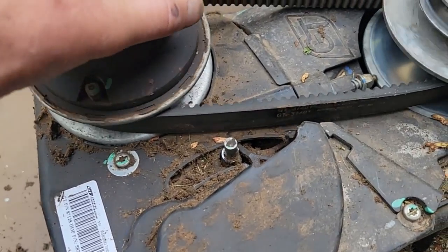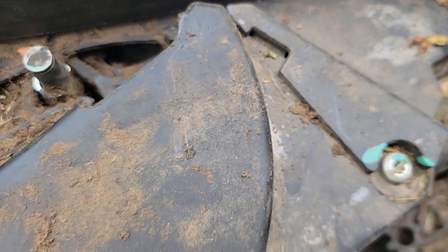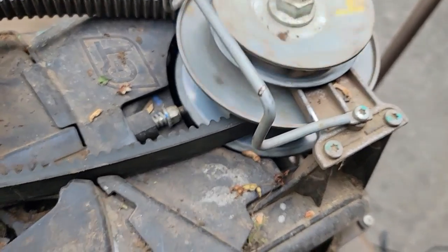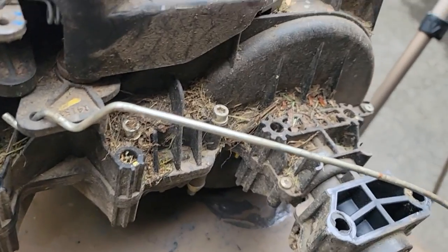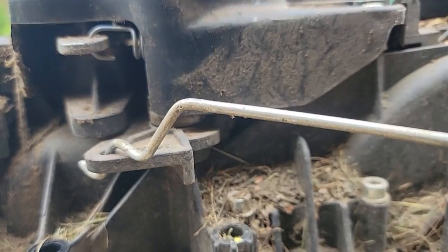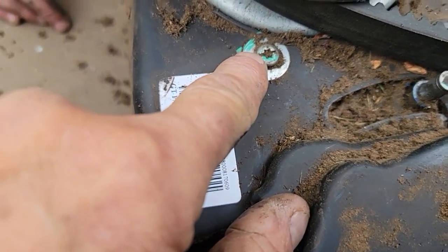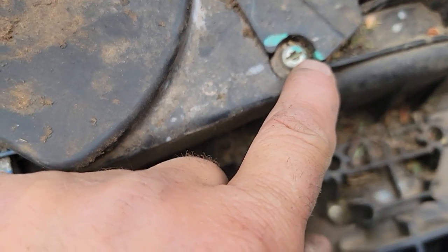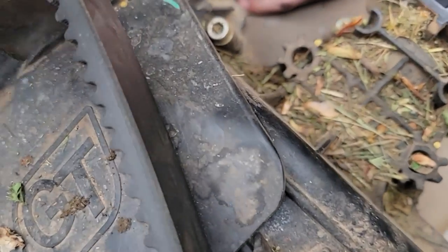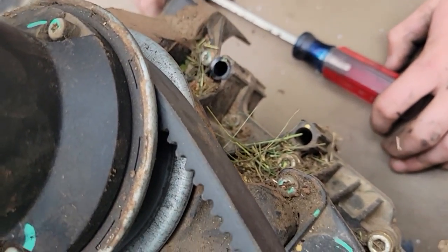I wanted to look this belt over — that thing looks brand new. The other belt looked brand new too. It can't be tight because otherwise when it's running the thing will be moving — you've got to have this free wheeling. I'm wondering if debris down under here is preventing it from moving forward. You see the paint — see how the paint lines up? I don't think this has ever been open. That's good — that means the previous owner probably didn't work on it. Same thing over here, that paint mark goes straight — nothing's been apart, which I like.